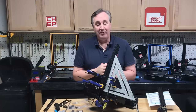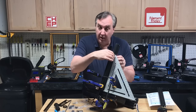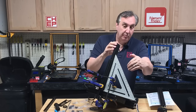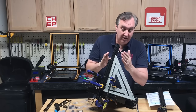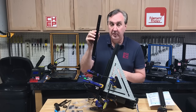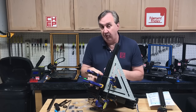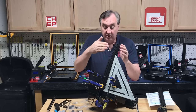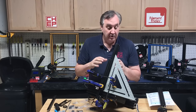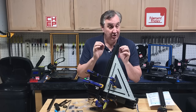It's nice to have the right tools here. I have a big speed square clamped to the upright and also to the base so it's 90 degrees in this direction. For the side-to-side I took one of the aluminum extrusions that came with it and clamped it to the side so it lines up with the base and the side of the upright — so it should be 90 degrees on this side as well. Now that everything's clamped up I can tighten those two screws and this upright should be perfect.